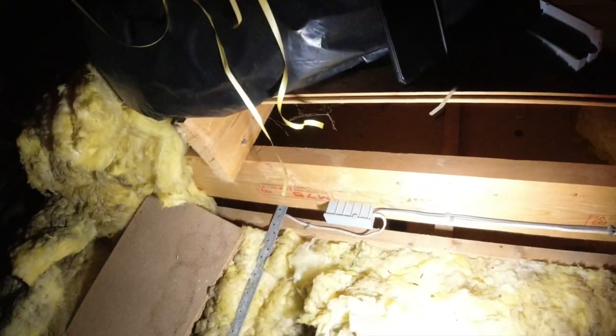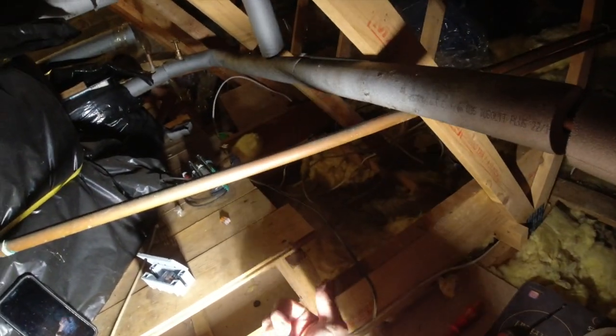We've then got to wire some lighting points along here back to the box, and then literally we'll end up with a junction box there with about six cables in it, which will do the fan, the lights, it will give us a feed in and the switch line down, so five cables. But once we get a little bit more done, we'll come back to you.